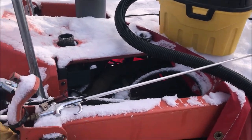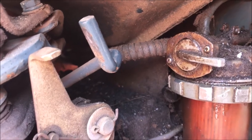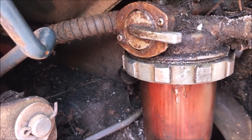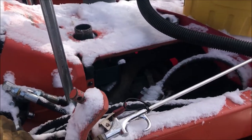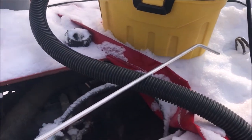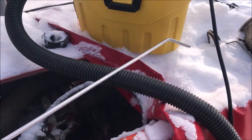Today I was thinking: if I pull all these different lines off that lead to the fuel filter, they're just little tiny lines and all they're going to tell me is that I have an obstruction in the tank. When I pulled this filter off I did find some chunks of rust. So right now I'm going to try to dislodge the crap that's in the tank first — I have this magic wand and I'm going to take it to the bottom of the tank and try to blow around where the filter should be and see if I can get some fuel flow.